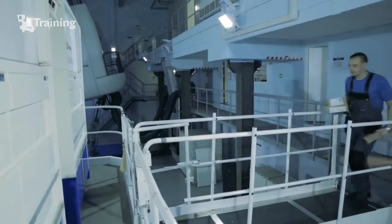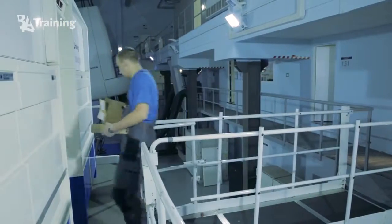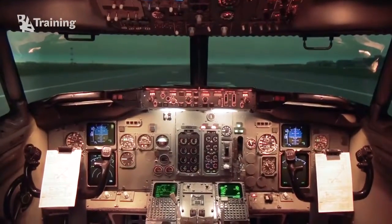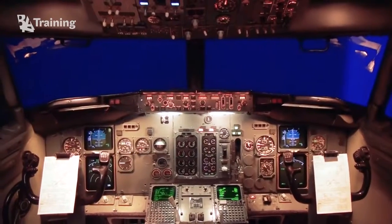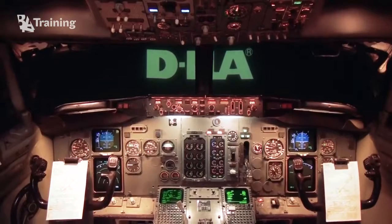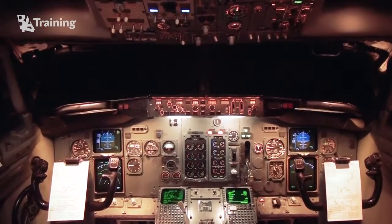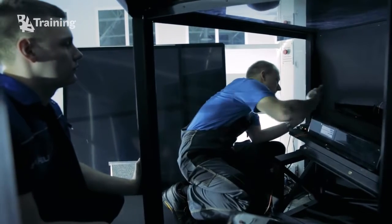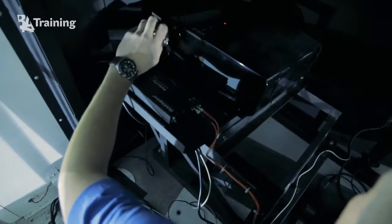When preparation is completed, the process of a projector update can be started. Stop the visual generator. Shut down all visual system computers and projectors. Isolate the visual system circuit assembly. Remove all covers to access the projectors area.